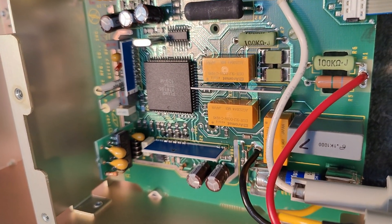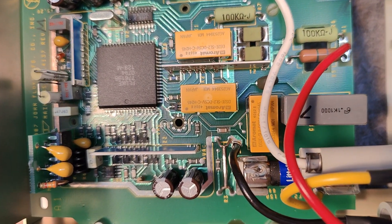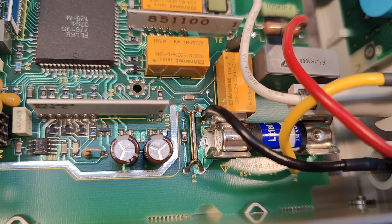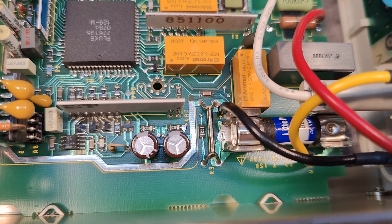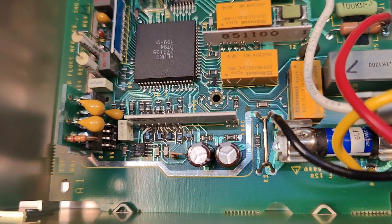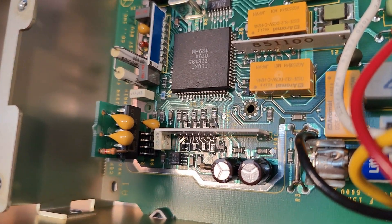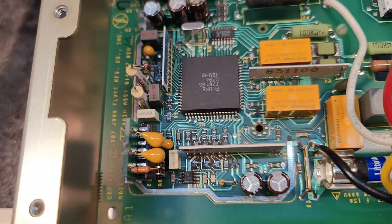Super, super accurate and stable. And there you've got some relays to select between voltage, AC, current, and so on. These current sense resistors — see? — with a four-point measurement technique for super accuracy. That means the solder points are not part of the measurement, and that is important. That is good thinking. And that little additional board standing up here is the RMS or AC voltage measurement. There's another little precision voltage divider on the back of that one.